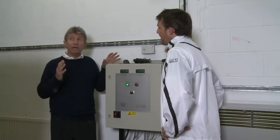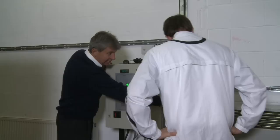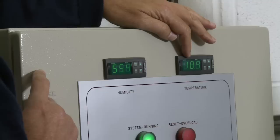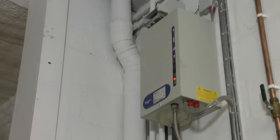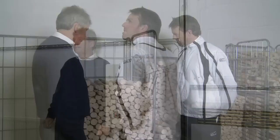As you can see, there are no windows. It's well insulated. Here we have a panel very similar to the one in the big dehumidifier, and there's a small dehumidifying plant here that either sends out warm air or cold air, depending on whether the temperature needs to go up. We try to keep the humidity at about 55% and the temperature at around 20 degrees. If the air becomes too dry, there's a hot air unit up there that will throw out steam and the fan will circulate it, making the whole building more humid.